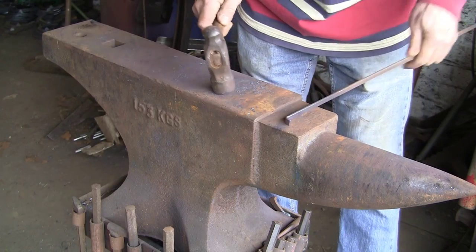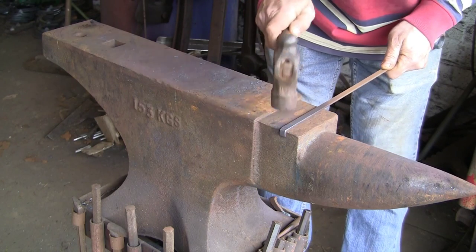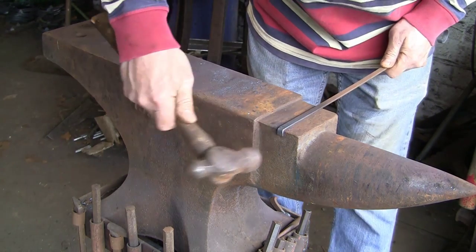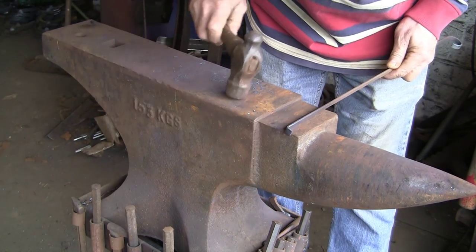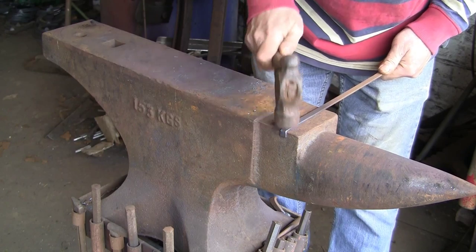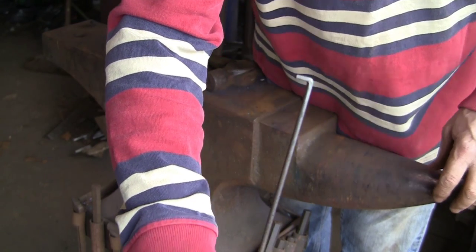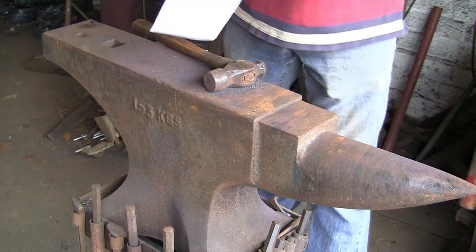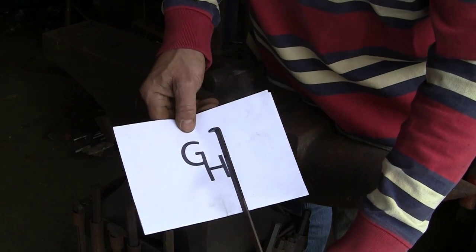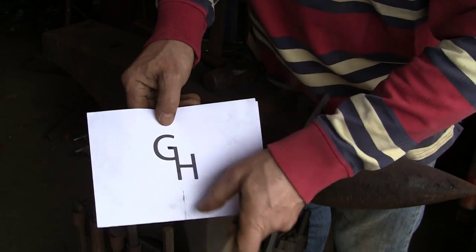Don't get rid of the radius completely but fill it up a little bit so it is a little bit squarer. I have heated it and I am just cooling out the very tip so that I can hit it without distorting it too much. Bash it back into itself. It doesn't have to be perfect, you know, it is only a brand. But I want to try and get it somewhere near. You don't want to thin it out too much by hitting it too much or hit the corner. I think that will probably do - near enough. Get it up to 90 degrees and that will do. That is a lot squarer than it was.